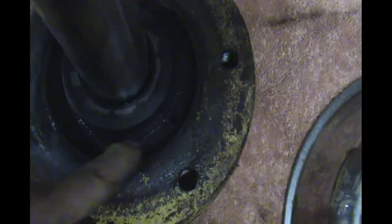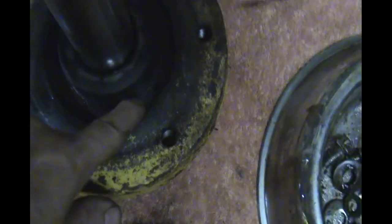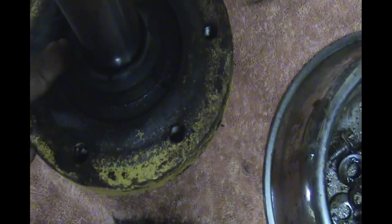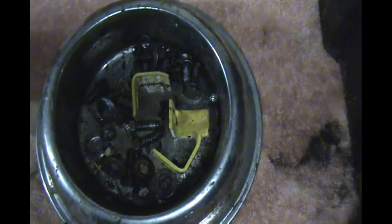You're supposed to grease that daily, and that fills this groove here with grease. This is on the back sides of the seals, and if you keep this full of grease, it's supposed to keep the dirt away from the seals, which makes the seals wear out. Got my bolts and my little clips